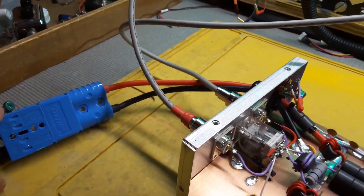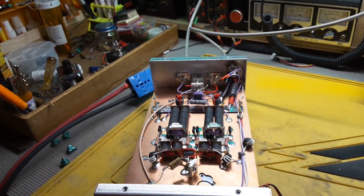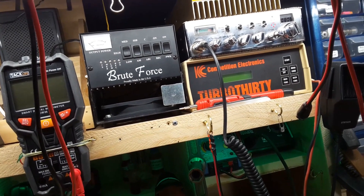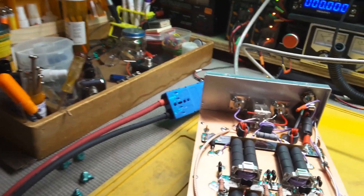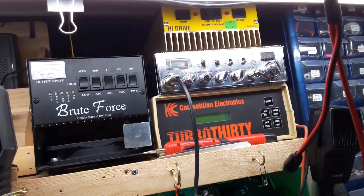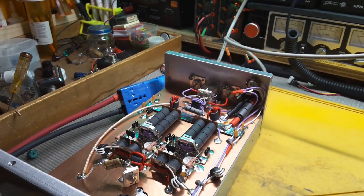It's swinging up to about 600 to 620 watts. I'm running it with that General Lee — it's got a 2 watt dead key and that radio swings up to about 40 watts. My voltage is dropping down to around 12.9 volts with a battery. It'll probably do more if I can maintain about 13.8 volts and get a radio that swings a little more into it. We'll do a little demonstration here.